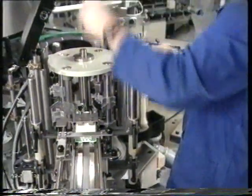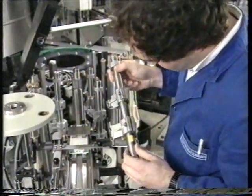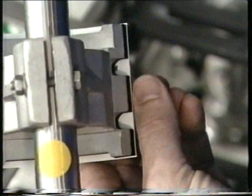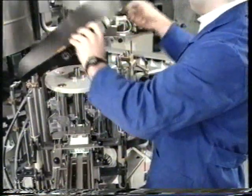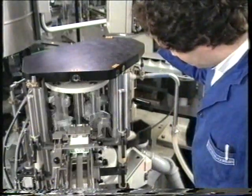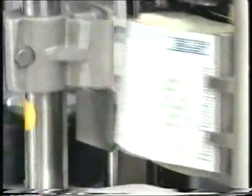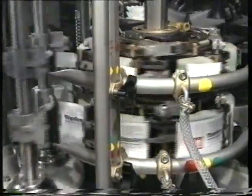Now let's check if the label is placed neatly on the palette. We take a palette out immediately after label removal. The label should protrude over the palette edge by 0.5 millimeters everywhere, thereby preventing the spreading of glue. Now the label removal by the gripper cylinder will be checked. Please pay attention that all gripper segments remove the label reliably. The label blasting must blow the label onto the middle of the gripper sponge in order to hold it stable for the transfer.